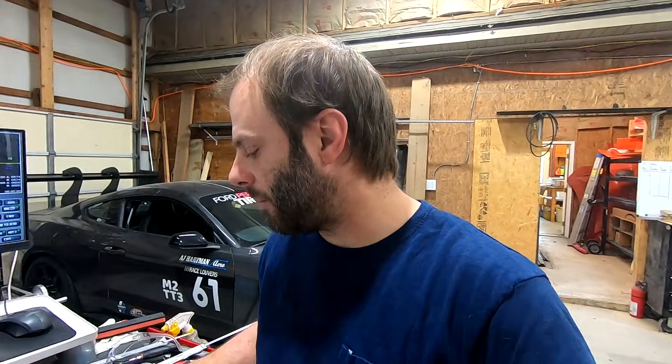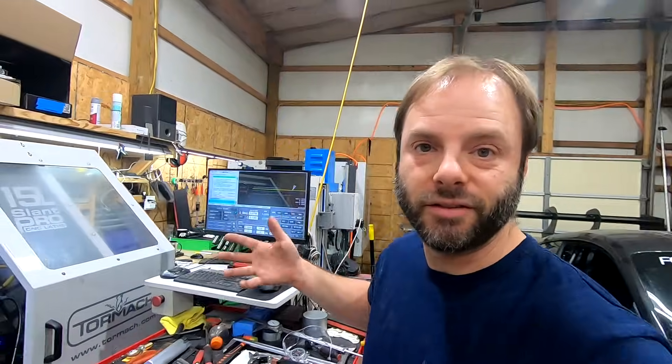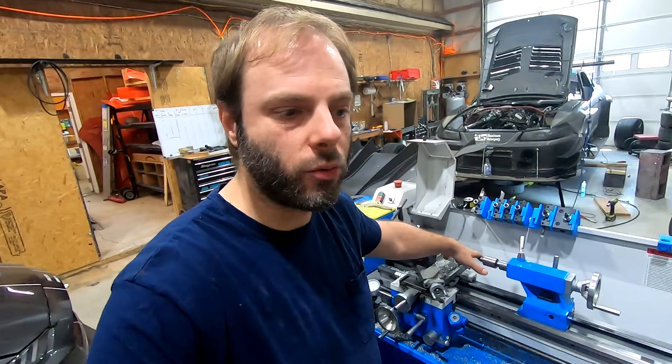The next issue is I only have one ER-20 collet holder. Here's the tap that we're gonna be using — I do have a collet the size I need for that tap, but it's already being used on this drill. I just ordered another ER-20 collet holder for the lathe, but sometimes you just gotta do it with what you have on hand. So when we pop them out, we'll put it on the manual lathe here, tap it — at least get the tap started straight — and then finish by hand. Easy enough.